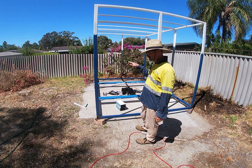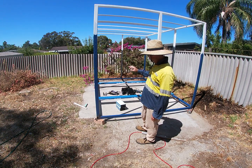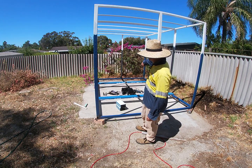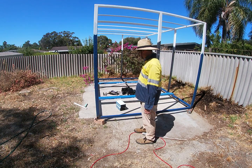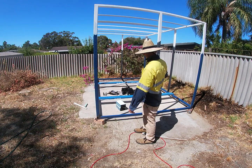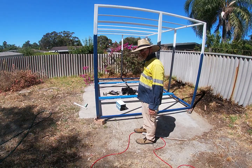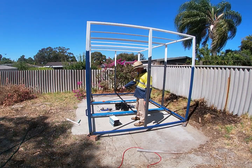On top of these will sit the floor plies. So I'm going to put them in. I'm going to just maybe run some diagonals through here to just give the floor a bit of extra rigidity. If the floor is a bit springy, I'll have to run some extra edging along for the floor plies to sit on.